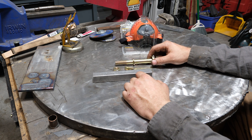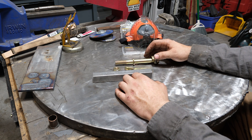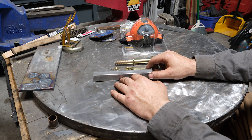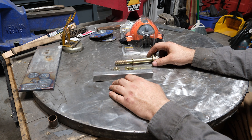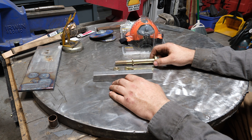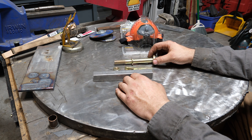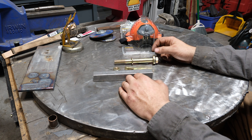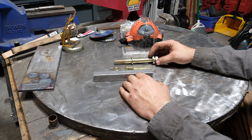I'm not a huge fan of MIG welding plated stuff. I find the ideal process, believe it or not, is standard flux core gasless wire — that works best in my opinion. You're still going to get porosity in the welds, but you will make plenty strong welds on most material like this and thinner. For welding nuts on something, flux core tends to be a little more brittle for self-shielded, but it is still an option. The other option is 6010 or 6011 — those are great rods and very common in the fence industry to weld 6011 on fencing and posts because it works so well welding straight over zinc.